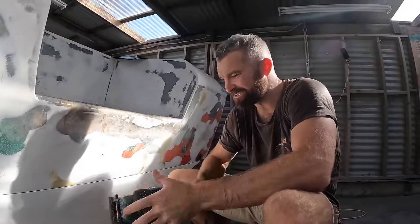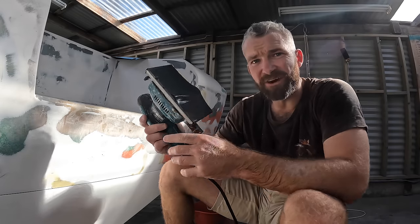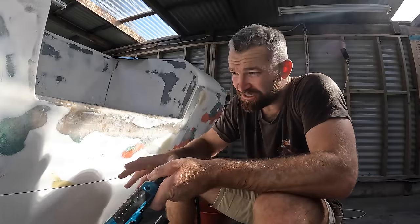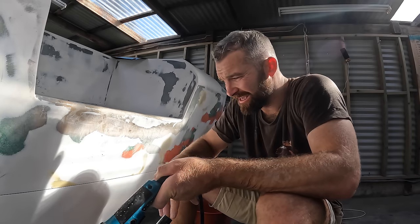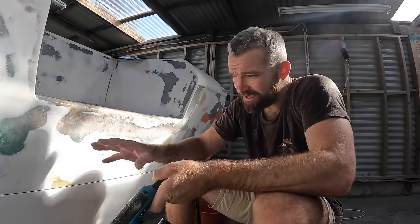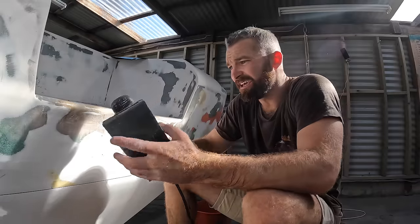Well, folks, I just finished the final sand, I was using 1500 grit wet and dry there. So with the grades, I ended up starting out with a 320, and I did a 400 over that. Now the 320 was probably the most aggressive, with the most time spent on it. 400, a fair bit over the top of that. I skipped 600 because I just didn't have any and couldn't get any today, unfortunately. Straight to 800, and then I've gone down to the 1200 for a little bit, and then just a quick finish off with the 1500.